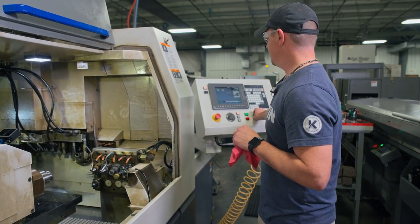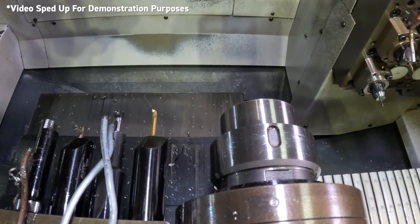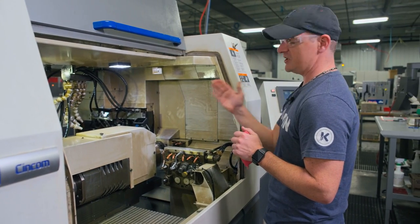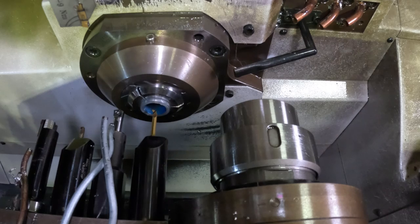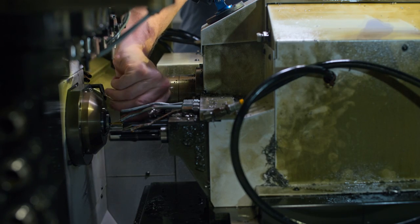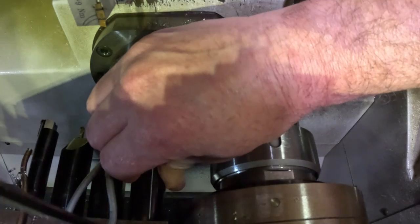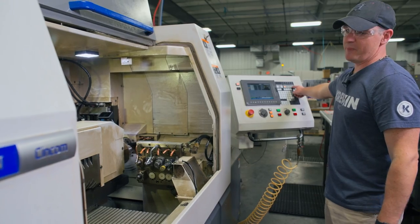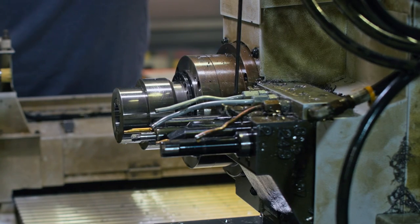From here: longitude, man set, cycle start. The gang picks up, moves up out of the way, and it's going to come to a set position forward. With the material in the way since we're cutting tubular stock, we can't set off the center — we're going to have to shift over a little bit and move our tool out to touch the face of the steel. We'll go to manual, go to X2, and jog the tool over. Pull the tool holder out to the face of the material. Once your insert is set to the face of the material, give one of the set screws a little bit of torque just so it doesn't move. Get your hands out of the machine. We'll go back to preparation, hit opposite retract — that will send the sub spindle home. With that in its own position I will use the set screws and lock that tool in place.